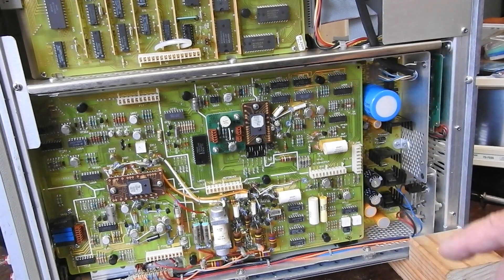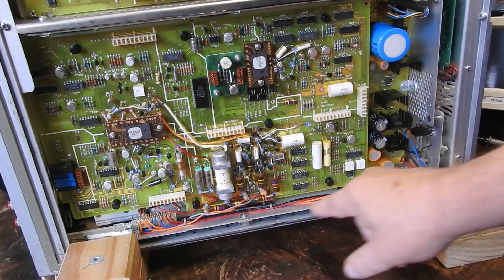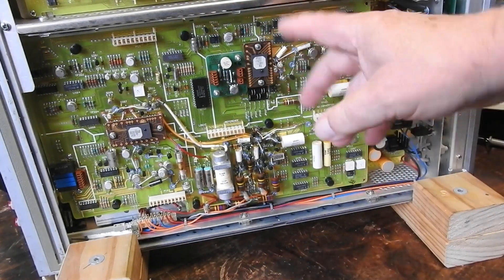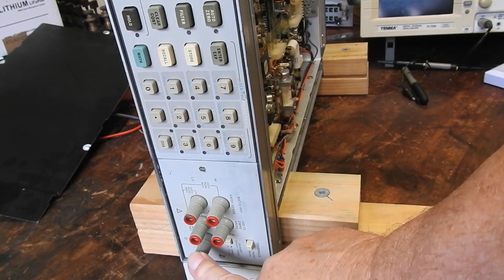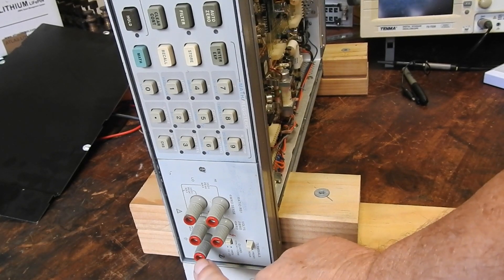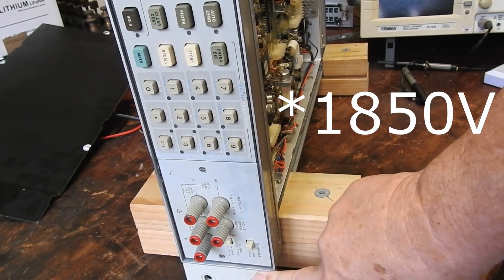Then there's the inguard section, which is mostly analogue and electrically isolated — it lives in a shielded case. The internal case is electrically isolated from the outside frame and is all shielded, so it can operate at non-ground potential. This whole internal frame for the inguard section is connected to the guard terminal, and that guard terminal can be up to 500 volts from earth frame ground. There can be up to 350 volts between the guard terminal and the low analogue input, and up to 1000 volts between the low and high inputs — so nearly 1800 volts between that and frame ground.